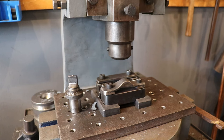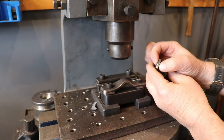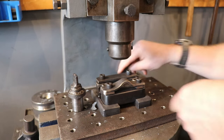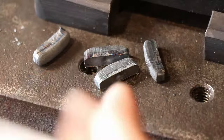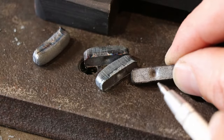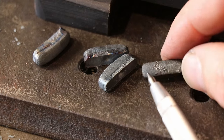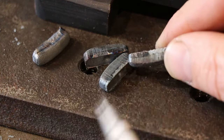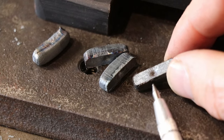The only critical dimension is the tolerance between the width of the punch and the width of the slot it's punching through. Let's take a look at these slugs to see how well I guessed on my tolerance. You can see that center feature clearly in the slug, there's a bit of a ragged edge where it pushed through, and you can see how it's rounded on the top part. I think that's a fairly clean punch and perfectly adequate for what I'm trying to do.